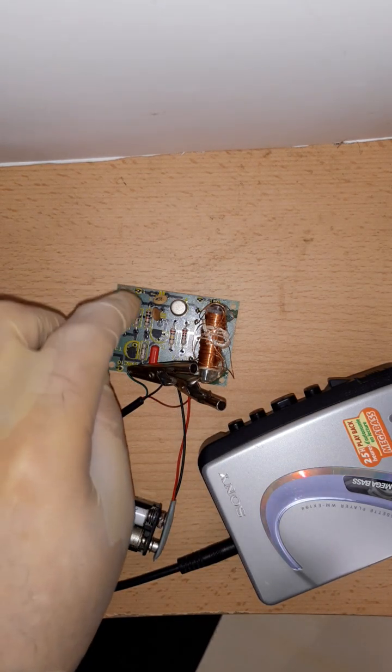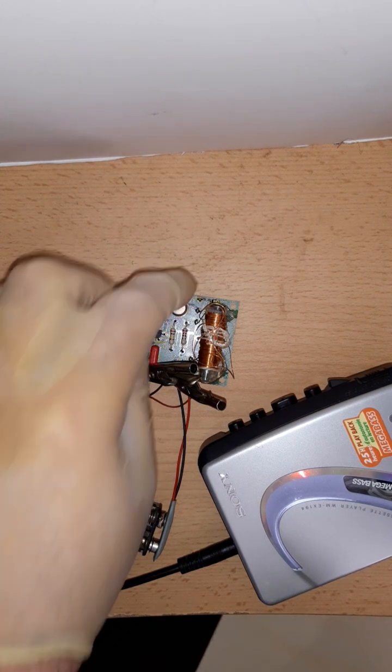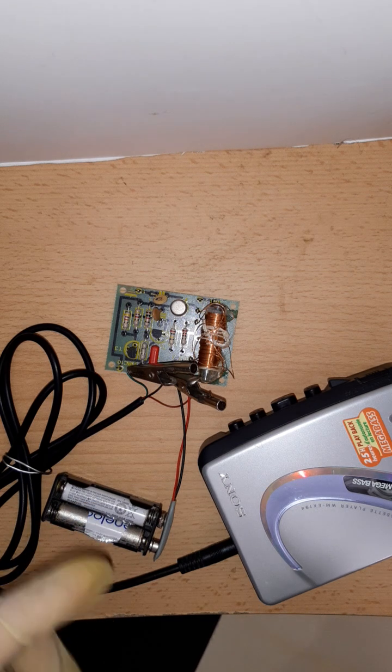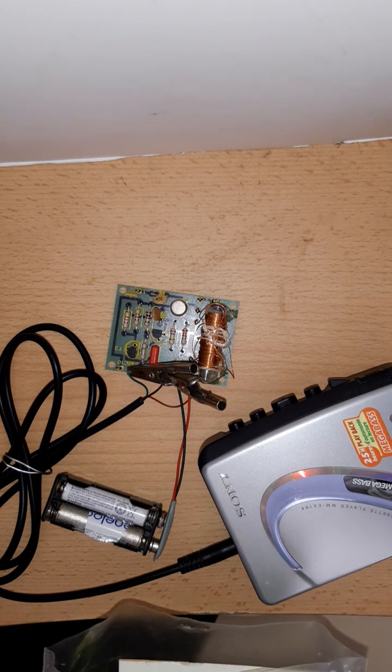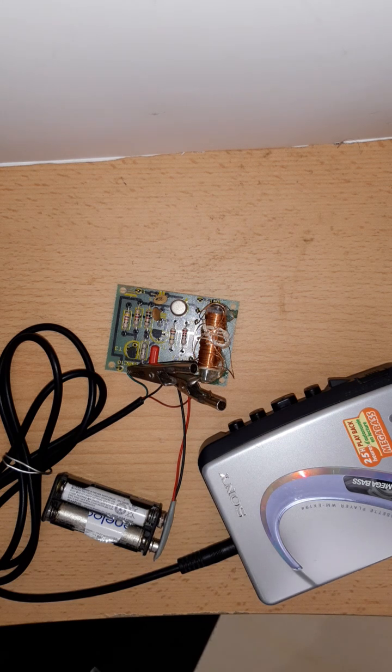Actually, connecting it to ground will work because if you follow the traces, the antenna pin is connected to plus from the battery, and the ground, which should be ground, is connected to the RF output. I think it goes to the collector of the transistor or so. So yeah, this is a bit confusing. And I think I can show you some of the info they give you, let me just see. Like they tell you some stuff.